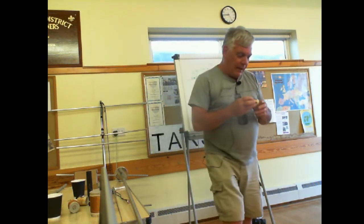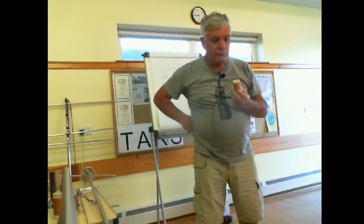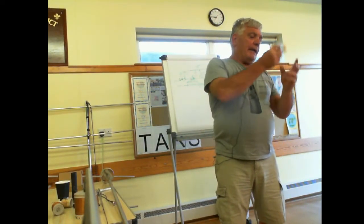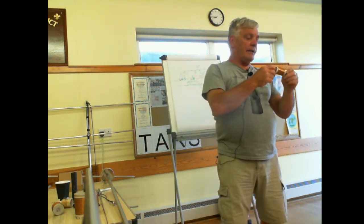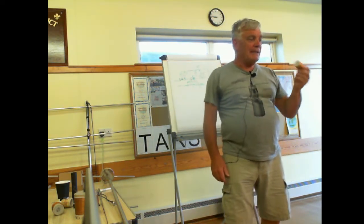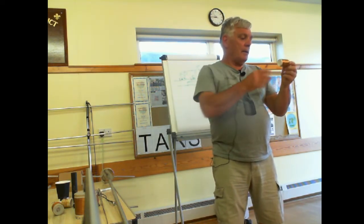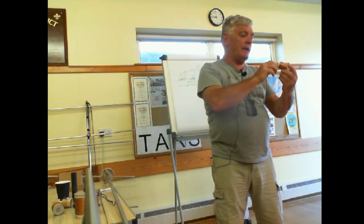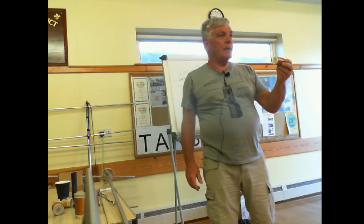One of the other things that I have made, like this is a part of one, is making a coil like that and then putting a capacitor, connecting either end with a capacitor, and that makes the thing we call a trap. Basically speaking, a trap is a resonant length. So say for example that one, probably with 50 pF capacitor, probably would be a trap for 40 metre band.